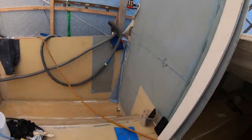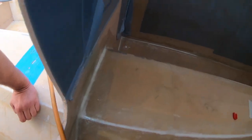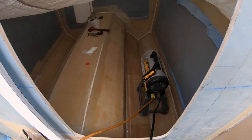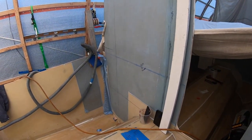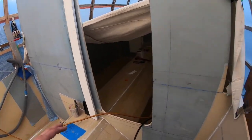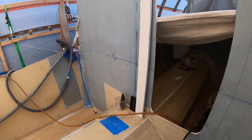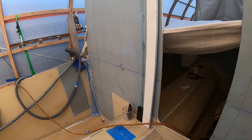We just finished tabbing in bulkhead 2 and bulkhead 3 all the way around. We tarped off the top and tented it out, and put our little bullet heater in. It's going to get cold tonight — the high today was only about 45 to 50. We've got everything glassed on. The heater should heat up this little area — I can already feel the difference sticking my hand in; it's got to be 80 in there already. We'll let that cure with the heat on for the night and turn it down just a little bit later. First two bulkheads, one side is done on both of them — great start.